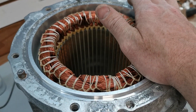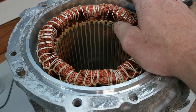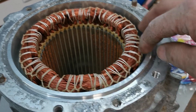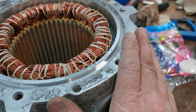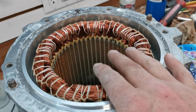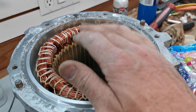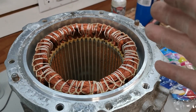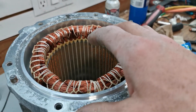By pulling heat from each end of the stator out to the housing quicker, it'll help the motor run cooler overall. If you do a run where your windings get to 200 degrees Celsius because you're pushing hard, that'll drop back down really fast — it'll conduct heat out through the length of the winding, back to the end turns, to the housing. Not only that, but it'll start at a lower temperature on the next run. In a drag race, a burnout puts some heat into the winding, so cooling back off before the run actually helps.